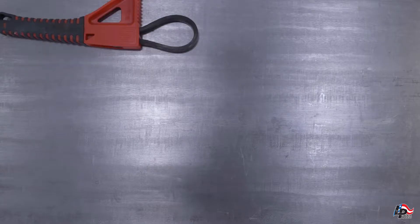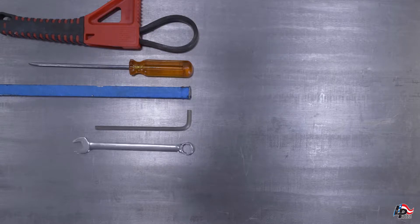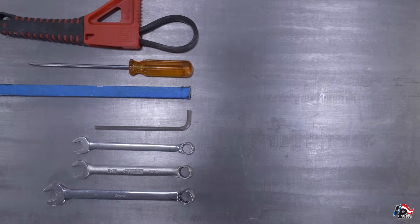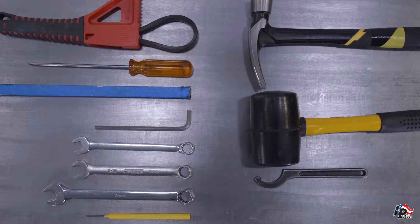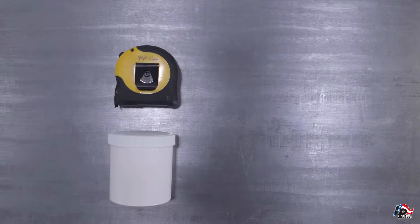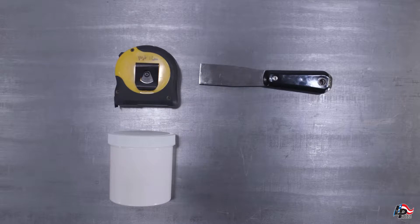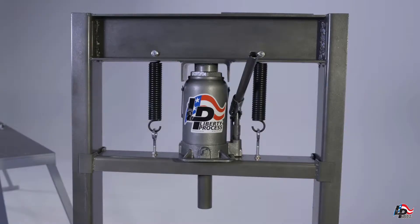Tools required for the assembly of the Liberty Series LL3 Progressive Cavity Pump: a strap wrench, pipe wrench, or chain wrench; a small flat bladed screwdriver; a dowel rod less than an inch in diameter; a quarter-inch Allen wrench; a half-inch, 9-16ths, and 5-8ths inch wrench; a pin punch 3-16ths of an inch in diameter or smaller; a hammer; a soft hammer or rubber mallet; an appropriately sized or adjustable hook spanner wrench for tightening the pump drive shaft lock nut; a level; a tape measure; bearing grease, either new or salvaged from the disassembly; a putty knife for applying bearing grease; pipe thread sealant; a vise mounted to a table or a stand; an arbor press or hydraulic press.